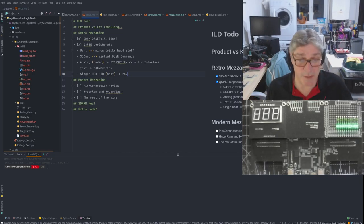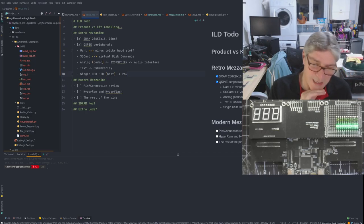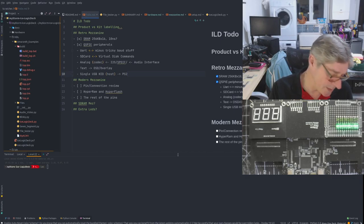So that could still work in an SRAM situation because it's 320x240. Hold on. 320x240. What is it? An 8-bit 422 YUV or is it RGB? How many bytes is that per pixel, in your default calculations?